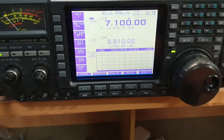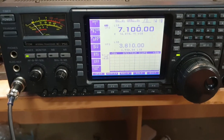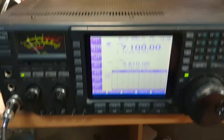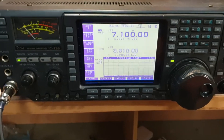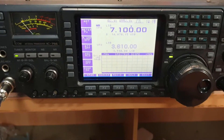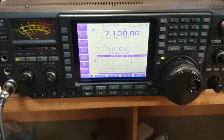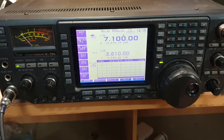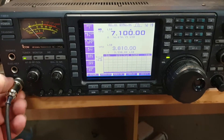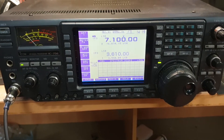This is an old one — I got it from Jamie down in Tassie and we've just been using it as a workshop clunker. But the more time I spend using it, there's not a mark on it. It's actually a great piece and the screen is perfect on it. If anyone knows 756 series monochrome screens — we've still got a couple spare here. I've got another one or two of these radios in the box. They're a great old radio, 0 to 30 MHz, 100 watts all day long — just don't let the screen play up on you and you'll be right.